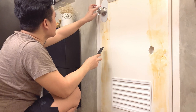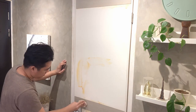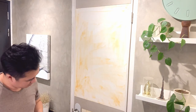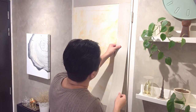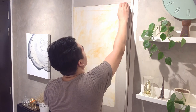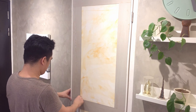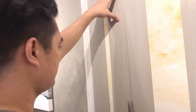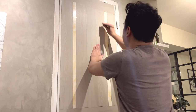I'm using typical rugby adhesive here because we ran out of the other adhesive — the smell is a bit strong but bearable. I had to test whether rugby works on plastic-on-plastic. After applying the rugby, you need to apply it to both the floor vinyl and the door, then wait at least 30 minutes — I waited one hour so it would dry better and stick more firmly. I used the same spatula from the floating shelves project to press it down so it adheres better and doesn't come off easily.